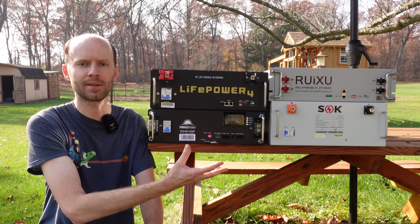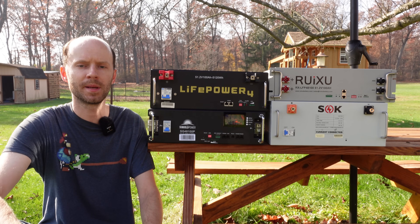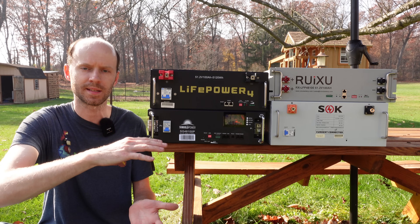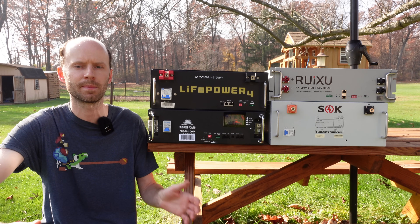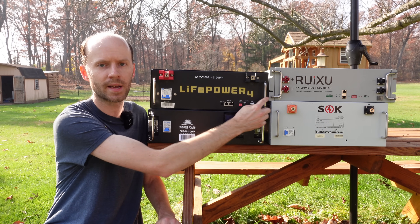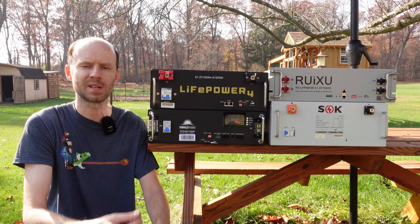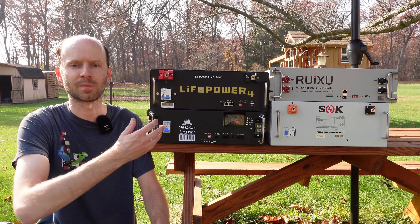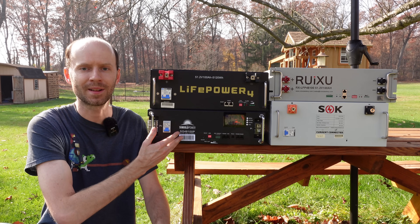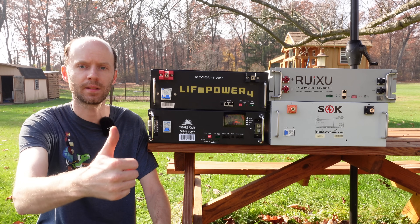In conclusion, these are all great batteries, some more than others, but the Rooksu is the front runner for my personal favorite. With these batteries being so similar, we're really getting down to nitpicking details just for the sake of finding differences. I like that the Rooksu is more energy dense and takes up less space in the rack, and the case feels more solid. Some things I don't like: no circuit breaker, and you cannot remove the rack ears without also removing the handles. The SunGold Power isn't bad, but there are a lot of unknowns and I've been receiving a lot of feedback on their customer service that I can't ignore. I also don't know that they are shipping correctly per the shipping regulations for lithium iron phosphate batteries. Please let me know what you guys think — hit that like button before you go, and thanks for watching.